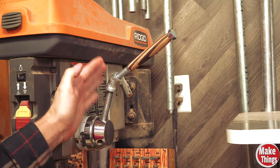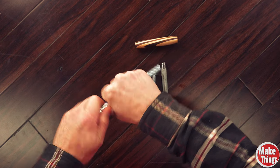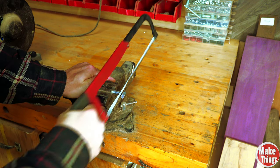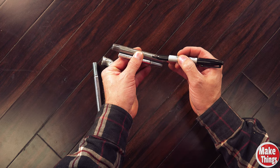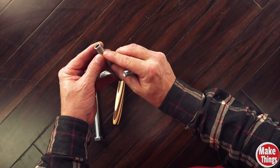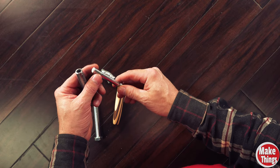I'll show you quickly how I put this together. To build this, these five different pieces are all I really need. I like to be able to grab onto something and spin it rather than just having something twist in my hand. The threading here fits inside my drill press handle, so the first thing I'm going to do is cut this off right here. Then I take the second tube and cut it to this length. It needs to fit inside the hole, but there are two problems: the seam through the center, and it's just a little too big. So I'll cut a groove down the side, chuck it up on the drill press, and sand it down so it fits inside.